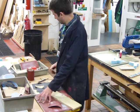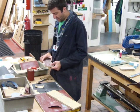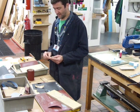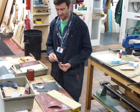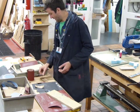So obviously a big sanding board here, and then this tray here of sanding boards, normally kept down there. Both have the advantage of having a rigid surface, so you can get hard edges, what have you, and you can customise, so you can put whatever grit you want on, and also attach it to whatever profile you want. So this dowel makes quite a nice internal radius of that particular size, for example.